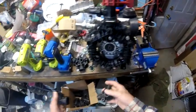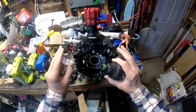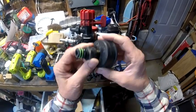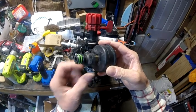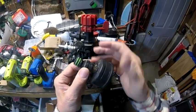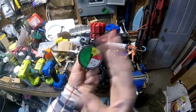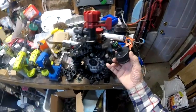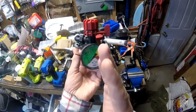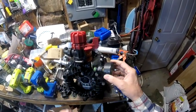Including the gauge — something I didn't expect was this O-ring right here popped out and was leaking, and my gauge was fluctuating constantly. I put the new gauge on, leak was gone, pressure steady. It's just a matter of a 30-second repair.